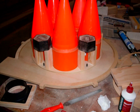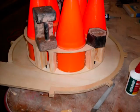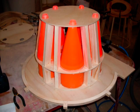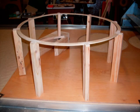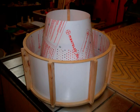Here we're building a bit of the frame to go around the outside of the inner five cyclones. It was all glued and screwed together to add a bit of strength. Later, polycarbonate sheets were added on the outside to give a nice smooth surface and to block the air from going straight in. Next, you can see polycarbonate sheets with a lot of holes being drilled in one of them — that's the shielding that filters the larger particles out of the inside cyclones.